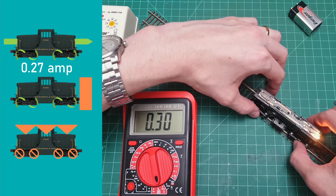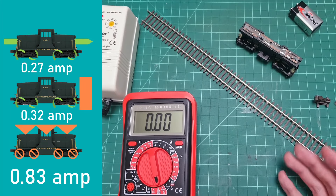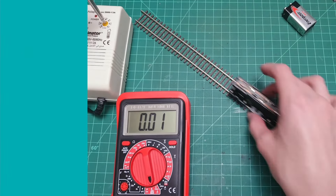If it would be a little above one amp, it technically would not pass the stall test. But in my mind, when are you ever truly going to stall a locomotive like that? You're never going to lean or sit on one. I find that the middle test — when the wheels are slipping — is more representative of real-life load. So that was a great test. Now, because the locomotive is not running very smoothly, I'm going to let it run in for two times 45 minutes — 45 minutes in one direction, 45 minutes in the other — with intervals of different speeds.